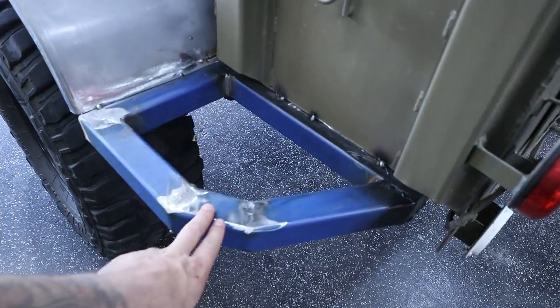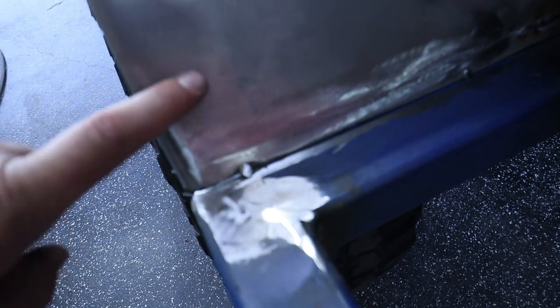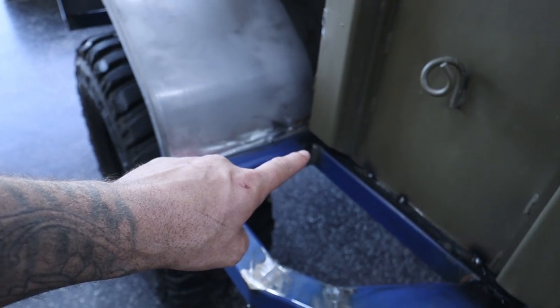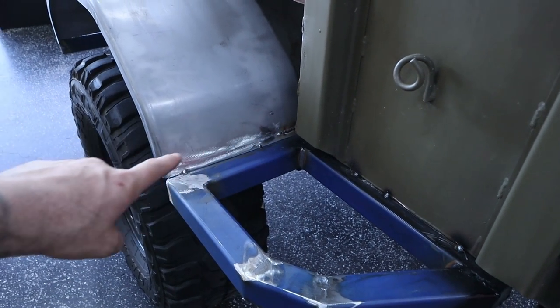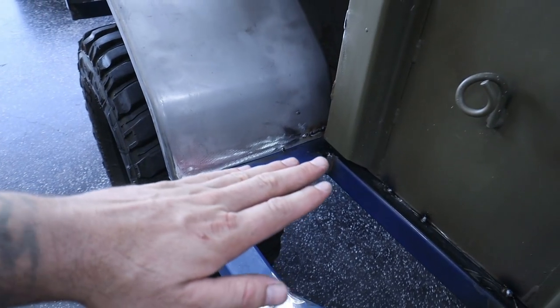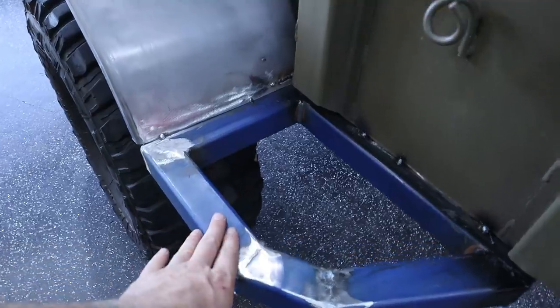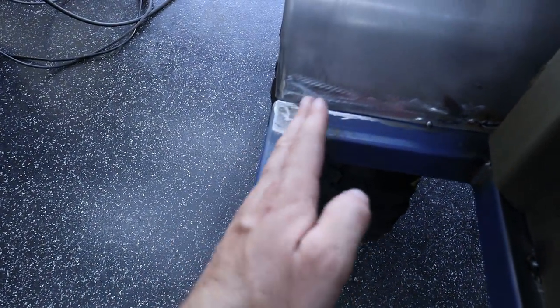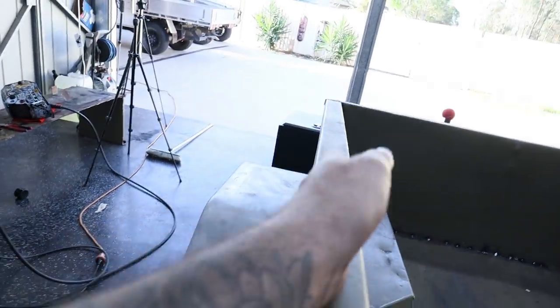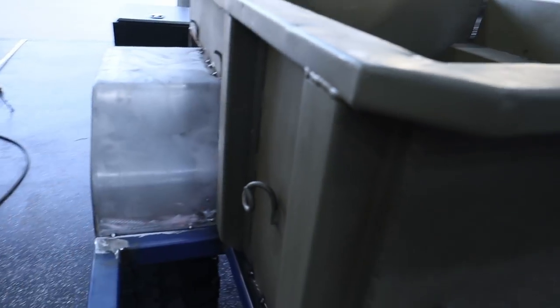These sliders at the rear are fully tacked on. And it kind of sucked because I had accidentally cut this mud guard too short. You might've seen it in the video. There was about a 15 mil gap from the box section to the guard. And I was compensating before by actually having it on a tilt and I didn't realize. I have actually got my angle meter out and this is 0 degrees and this is 0 degrees. So these sliders are perfectly true this way in comparison to the body.